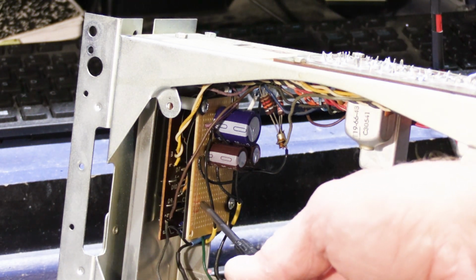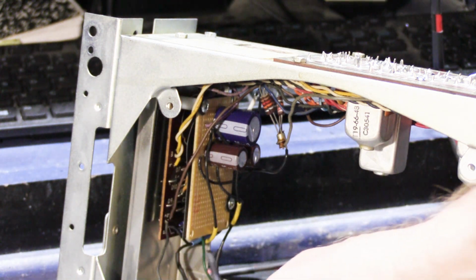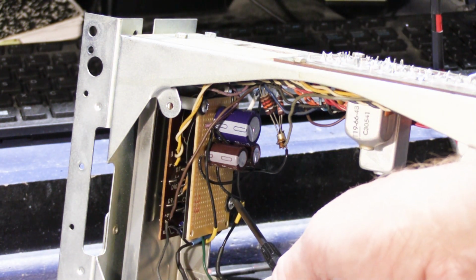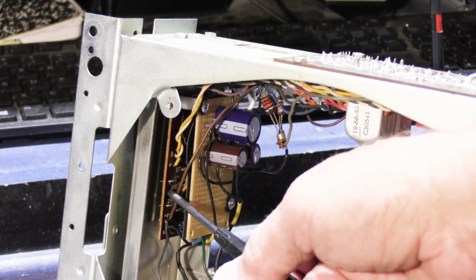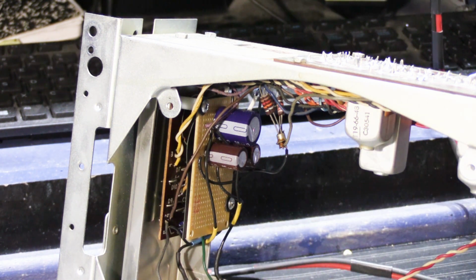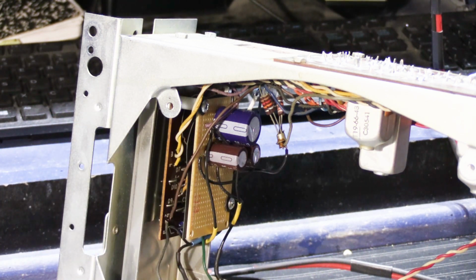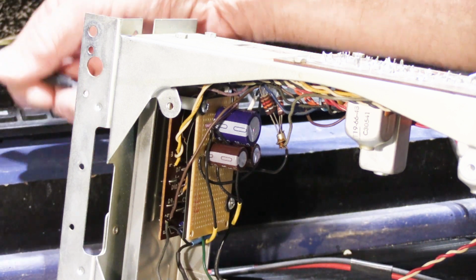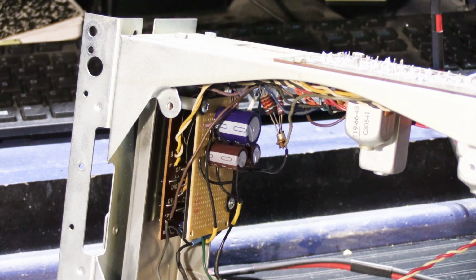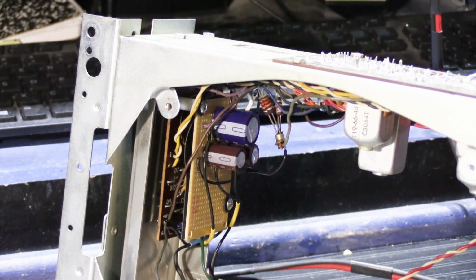Our little in-shop built replacement circuit board is then mounted on two nylon standoffs. There's one up here and one down over on the other side, and they have screws that go through them, and then they go through the mounting holes in the original power supply board and into the mounting screw locations on the power supply bracket assembly, and that again squeezes it all together and holds it in place. And then we use some new shorter screws through the end of the chassis to hold the mounting bracket in place, and now we have our replacement board, and as you can see, it's nice and sturdy. It's not flopping around in the breeze or anything like that. You notice a complete lack of wire ties and duct tape and things like that because that's not really the right way to do it.